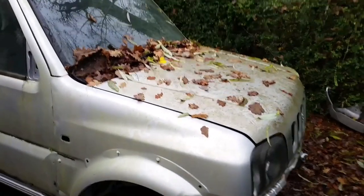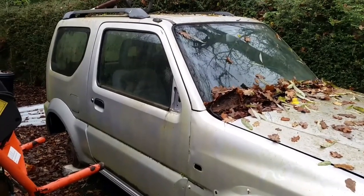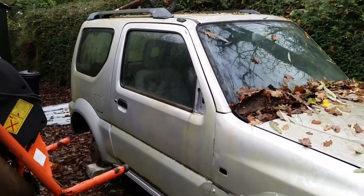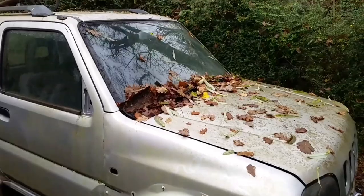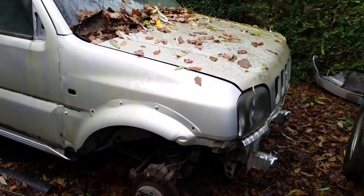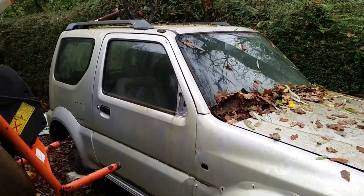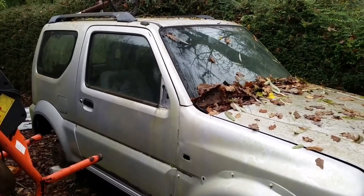This is the donor - the amphibious thing - a Suzuki Jimny, same as a Chevrolet Jimny. It has solid axles, coil springs, transfer case, high and low range, radius arms, power steering, and a 1.3 litre twin cam engine. The plan is to use every part of the drivetrain and running gear - axles, steering, gearbox, everything - modify the transfer case and put the whole lot into a marine grade aluminium monocoque hull. Hey presto, we have an amphibious Jeep - that's the plan anyway.